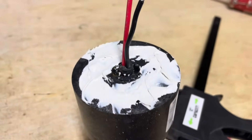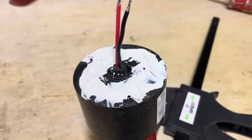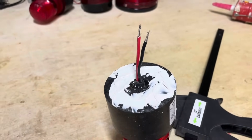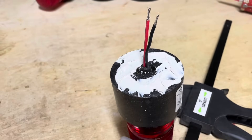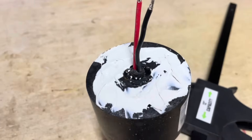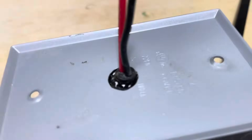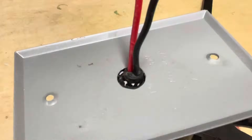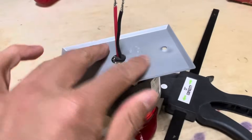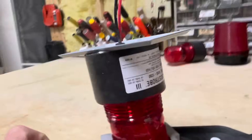That's a fairly generous spreading of Liquid Nails. What I've learned is that it's bad if you put a little bead on, because a thicker bead takes longer to dry and is actually less secure — it creates more of a soft joint. So you want to spread it across the surface area. Now I'm going to put this cover plate on, center it — you can see there's a little rubber grommet so there's no risk of the wires getting chafed — and push it on and rub it in. Within 24 hours this coating should be dry and we can put this up.